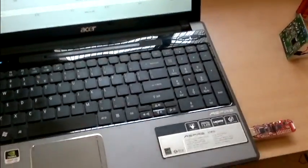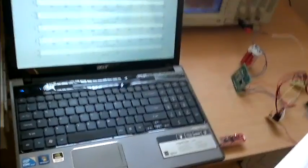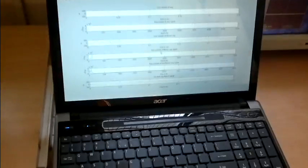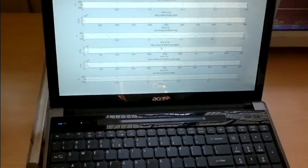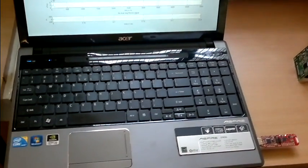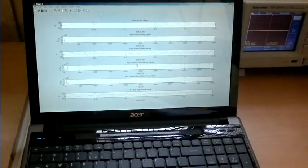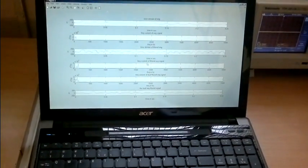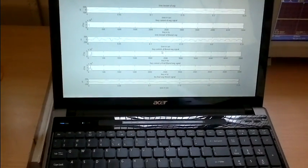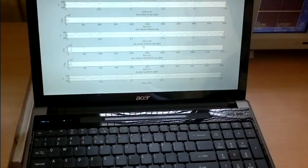MATLAB is then used to display the waveform after filtering. A 50 Hz notch IIR filter is implemented in MATLAB to remove the 50 Hz power line noise added while acquiring the signal through the active electrode. This notch filter can also be implemented in the MSP430 microcontroller, but here for ease we have implemented it in MATLAB. This means a simple display device would be enough to show the filtered waveform without always requiring a PC.